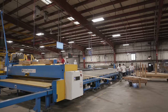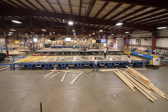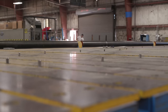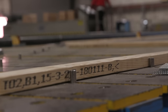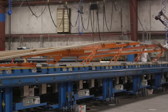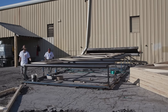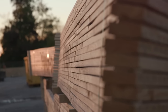After it's been all cut and bundled together, it goes over to the tables. One of the disadvantages of traditional truss making is you set up your table for a single type of truss and it takes a long time to switch over. With the automated jigging system called Wizard PDS, the pins will move. The new truss comes in, they see it on a screen, all of the pins move, and you're able to throw the material down up against those pins that are your new jig. You tap the plates on it with a hammer and then a roller rolls over the top. It's a two-step process — the main roller sets all of the plates, then it gets kicked off onto a conveyor roller through a finishing roller and comes out to the yard. They're able to get 9,000 board feet off of their automated table where the best they could do with the manual table with their best crew was 5,000 board feet.